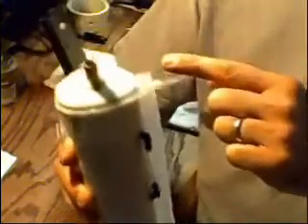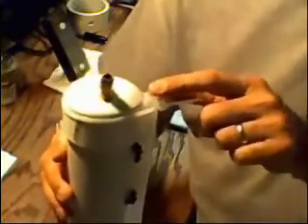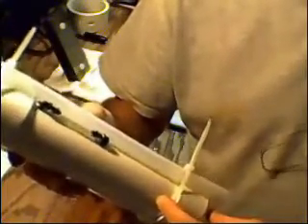What I was thinking: I added this tube here. You'll see how it comes off the bottom; I have it running up the side and it comes out right next to the outlet port of the tube. The reason I did that is — remember my bench top one always used to leak out every time — because we only have a two-inch riser in here, so that tube is always going to be underwater.